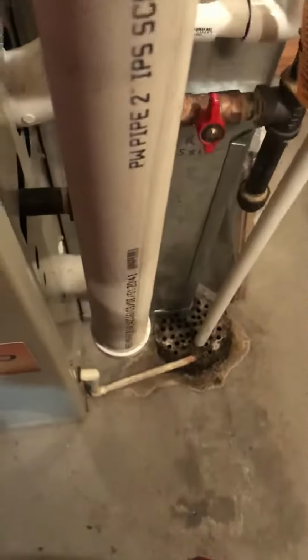All right, this is Eric and Ariel's furnace. It's got a cracked heat exchanger, so we're looking at replacing it. First, the return drop needs to be changed, or the furnace needs to be up on a base can, or do both, just so we can maximize the amount of airflow. It's only a 10 by 20, should be a 10 by 24.